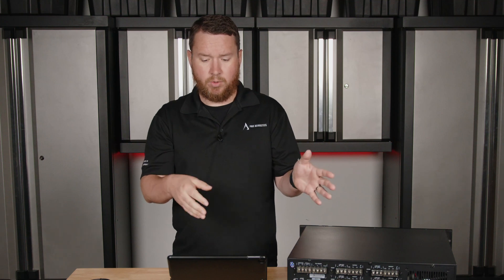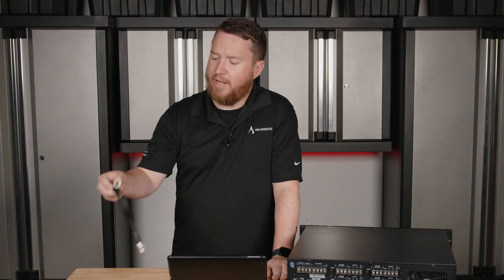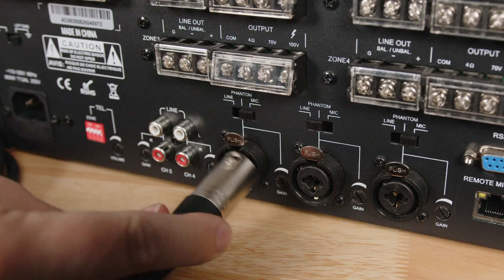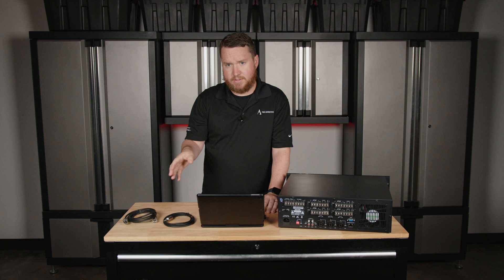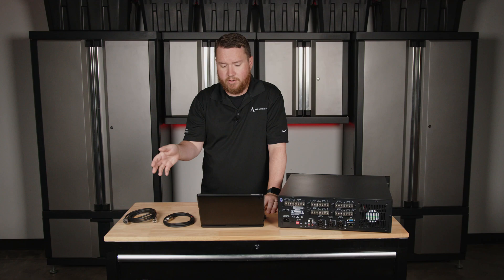Basically the main features of the XLR and quarter inch combo jack is that you can use either one of those connectors. Typically we're seeing a balanced connection when using an XLR — balanced meaning it's got positive, negative, and ground three-pin connections, which is useful because it locks in place and also is balanced so it can be run long distances, which helps to reduce audio noise and interference.